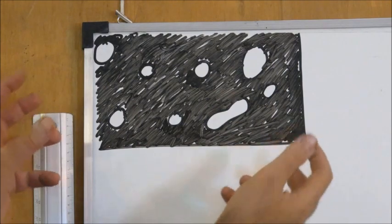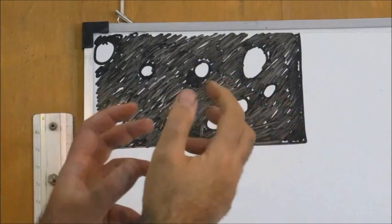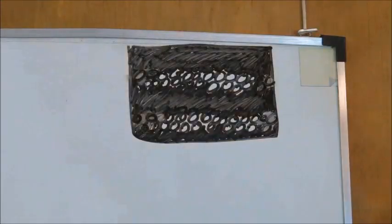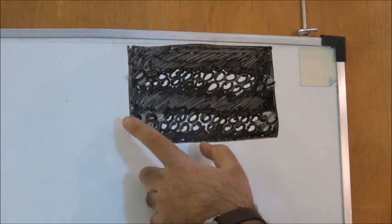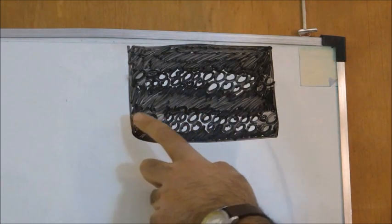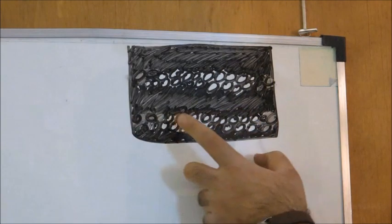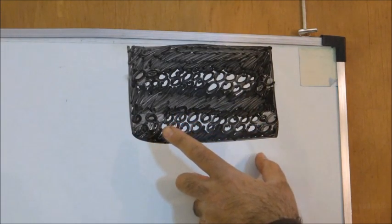When the sword bends, these particles are solid and it is the dark material that moves around these particles. In Fulade Juhardar, these cementite-type particles are agglomerated — gathered in lines or curves — and these are the white lines that we see with the bare eye on these materials.